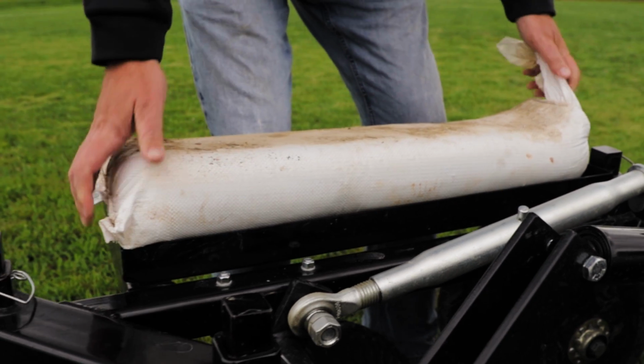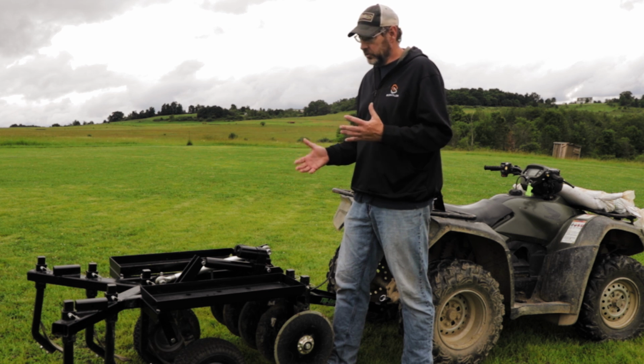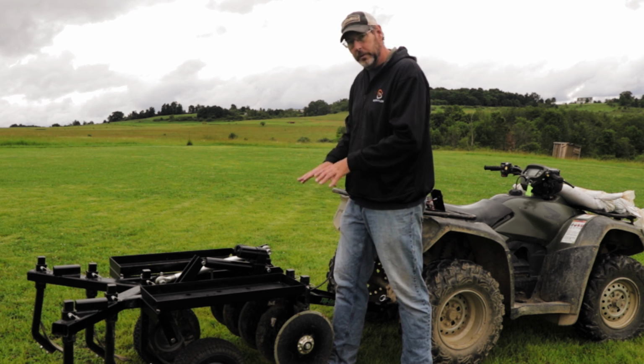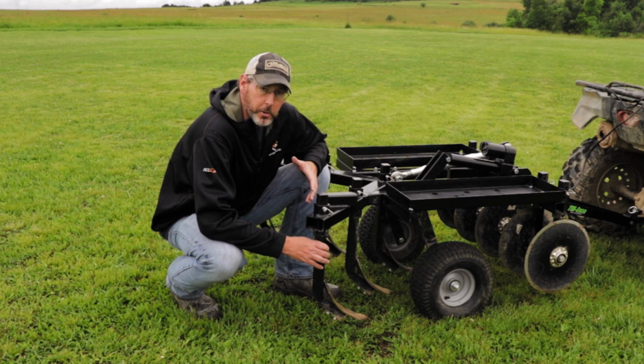If you're needing to get those coulters a little bit deeper and digging, you can put up to 300 pounds on these weight racks. But we did many of the plots with no weight at all. So you'll just have to gauge that. But these weight racks are perfect for that, and they're used for the coulters, which cut the ground before the chisel plows come through. Next, we have the main cutting tool, and this is the chisel plows themselves.